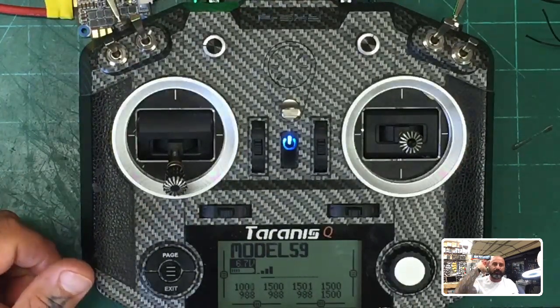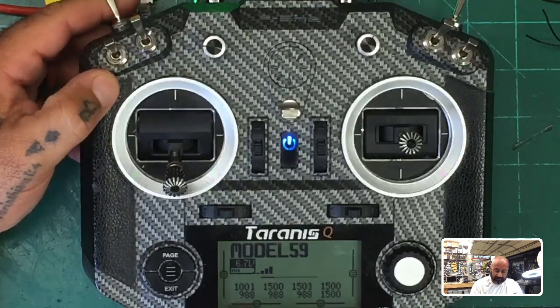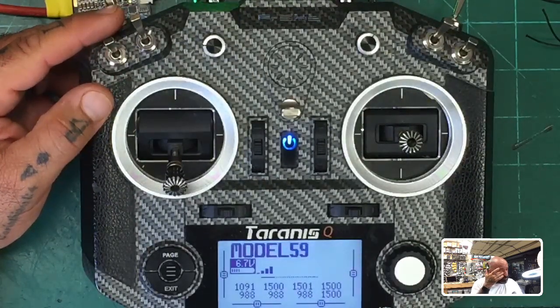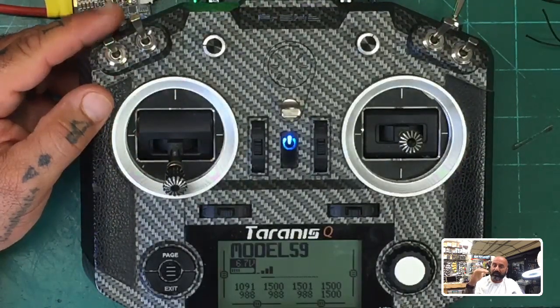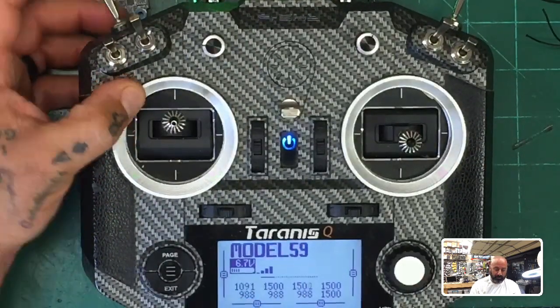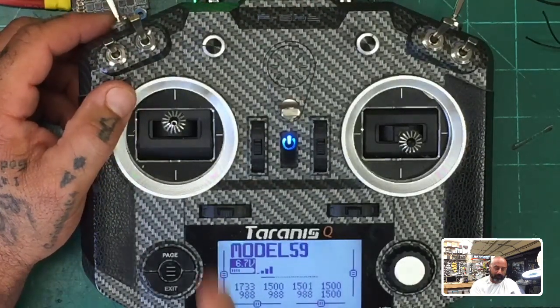And what I just do is, as soon as I'm flying, I can flip that switch. It'll hit the designated set speed or set throttle, right? Which is 1091 here instead of 1000. So you've gone up almost 10%, okay? And so it cuts the motors, leaves it spinning at 10%. Then when I'm ready to kick it back, I don't even have to move my throttle stick. See, look, if you look at the screen here, I'm at 1734, flip my switch, dude, 1091. Let it go back up. It's like hitting it just like that, but you don't have to touch the switch.